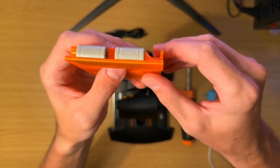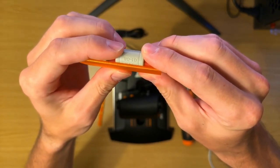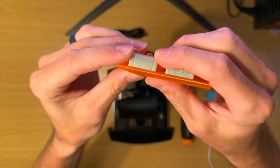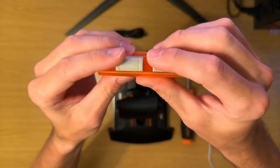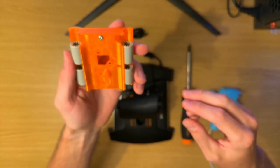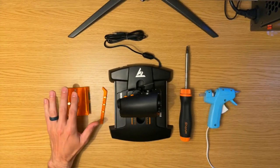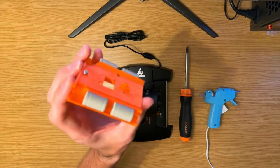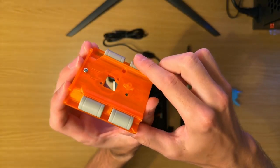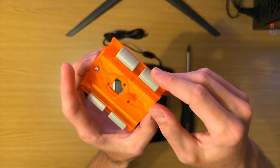One of the main features that makes the Mark III the Mark III is also the tapered bearing surfaces. You'll notice that these bushings rotate ever so slightly in both axes, and that will allow perfect alignment of them along the rails as they're installed. Because the rails that come with the throttle are not perfect, and neither are the bearings or bushings, so I added a little bit of flexibility in there. You'll also see that the bearings themselves don't just freely rotate, so it's still held in good contact but doesn't squeeze it so much that it will add extra friction, particularly for the polymer bushings.